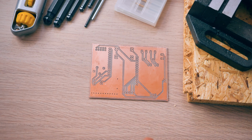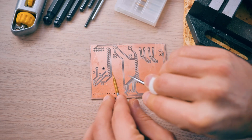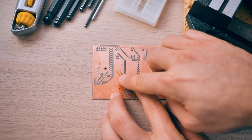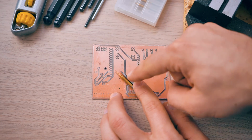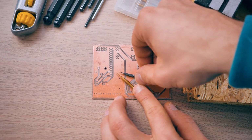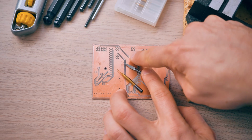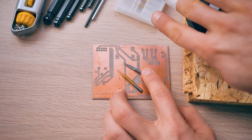The first thing obviously is those raised edges that I just talked about. Because I was using the milling cutter here instead of the engraving bits, these milling heads have a spiral flute to them. These just cut straight. So naturally, when this bit is turning, it will want to pull material up. Instead, these will just want to push it out sideways.